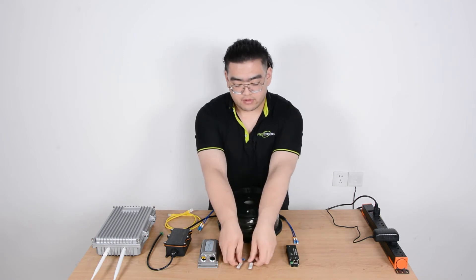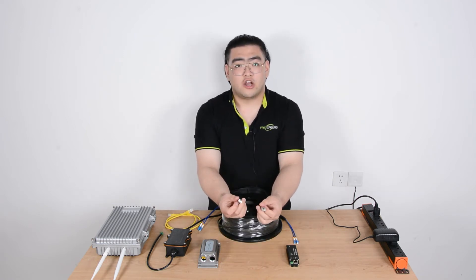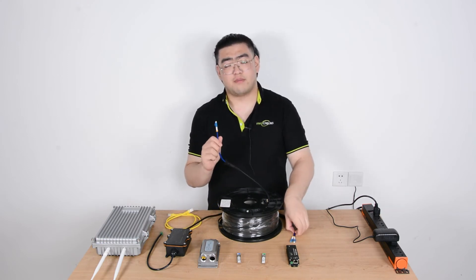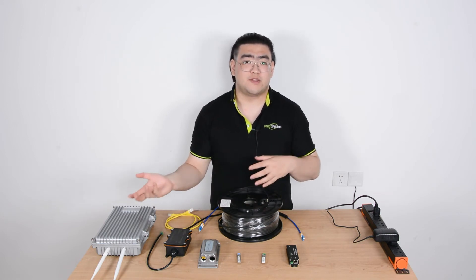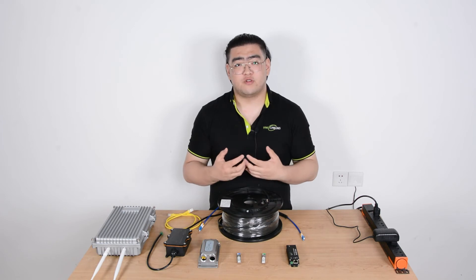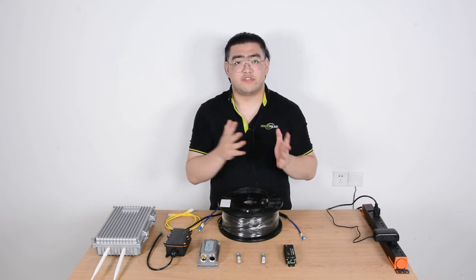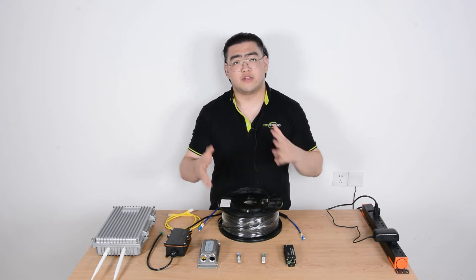The last two things are the SFP modules. The SFP modules are transmitters — they act as a transmission device which transmits signals to send them through the fiber optic cable, and also as a receiver to receive signals transmitted from the other end. They convert the signals mutually from digital to optical or optical to digital, depending on which end they are on.